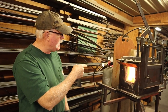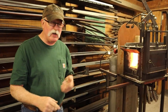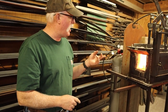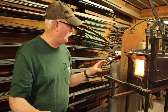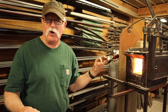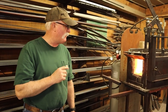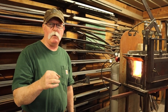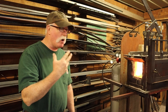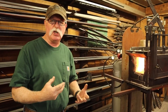So what I'm doing right now is we're preheating the hammerhead. I already cut the handle off. I'm going to re-drift the eye first to receive an axe handle, so I'm heating it up and getting ready to put a drift in it and try to drift that out a little bit, because right now it's got more just a standard hammer handle hole through it. The great thing about this is that you don't have all the forging tools to punch out a big hammerhead — you can just start with a ball-peen. It's just a little bit of a cheat, but it works, especially if you're just getting started.